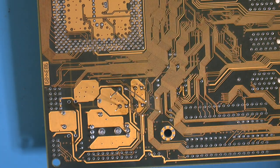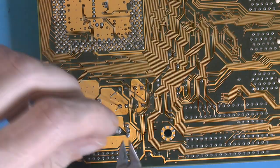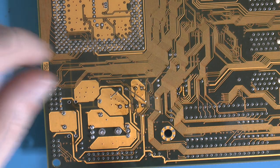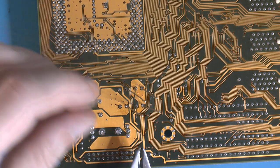1.6 is usually what you get with your iron if you buy a station, so it's always a good idea to get a 5mm and one around 2.5. And it should be of the chisel type, like an old screwdriver. There are other types that are also good, but of the generic ones, those are better. The pointy ones are kind of crap.